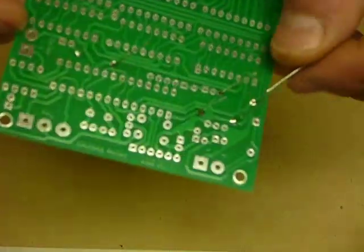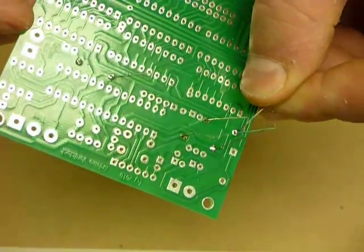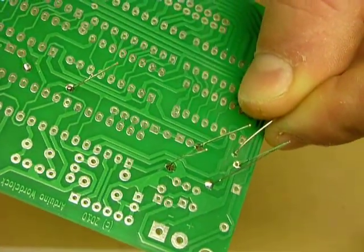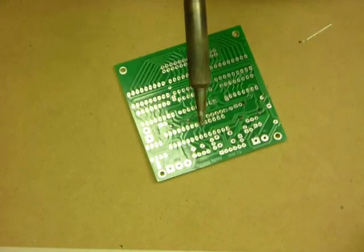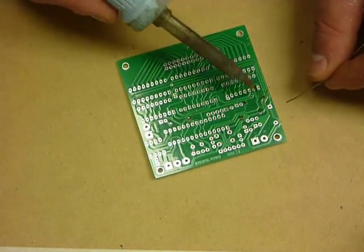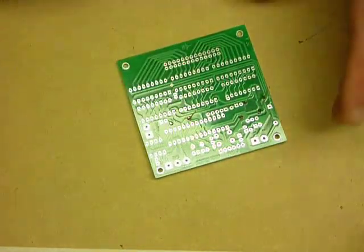The soldering iron, in fact, look at that. I missed that particular joint. Can you see how it's got this void? Hopefully the camera will focus. Yeah, see how clearly the solder hasn't covered that particular joint. So let's get back in. Soldering iron in, bit of solder, off.